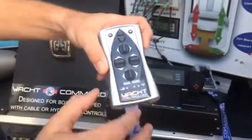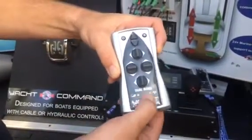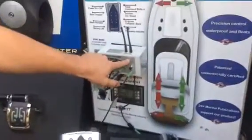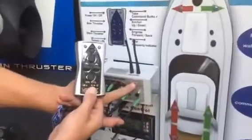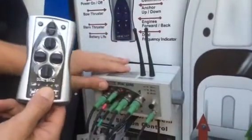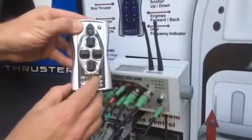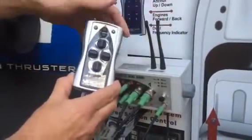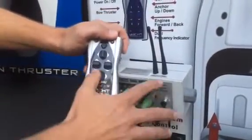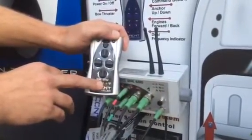The way that you know you're connected is if you look at these lights down here — they went from a full yellow to going back and forth. If you look at the receiver as well, you can see it has those two lights. The Yacht Controller system runs off a dual band frequency, which is constantly cycling every sixteenth of a second between two different frequencies to ensure connectivity with the receiver, and also to ensure that even if one of those frequencies is interrupted, you always have that redundant safety option of the second one.